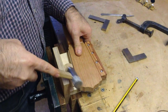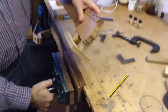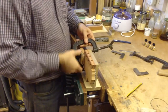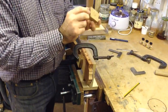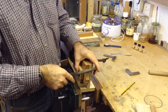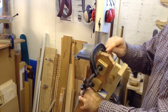It's moved slightly, so I'll adjust it. Now a couple of clamps with blocks that have a little bit of cork on the face that goes against the wood, because cedar is quite soft and you could mark it with too much pressure. The cork means I can clamp it properly without leaving marks. Now I'll do a visual check — it's nice and flat, the line is still in the right place.